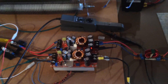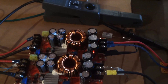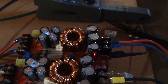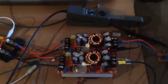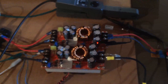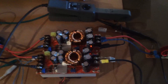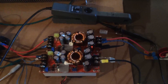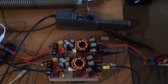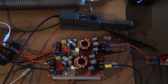The other issue with these type of converters: these are boost converters, and basically all the energy comes out of the inductors that you see here — these large inductors. These particular ones are used in flyback mode, so what that means is that you're switching these inductors at a hundred kilohertz switching frequency, which is quite high, and I'll show that on the oscilloscope in a few minutes.